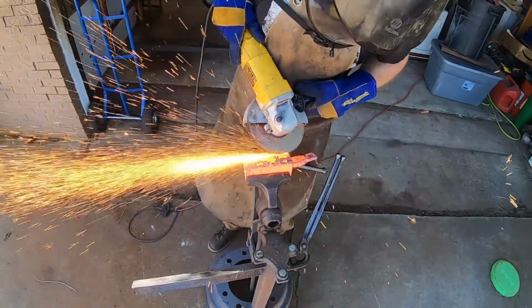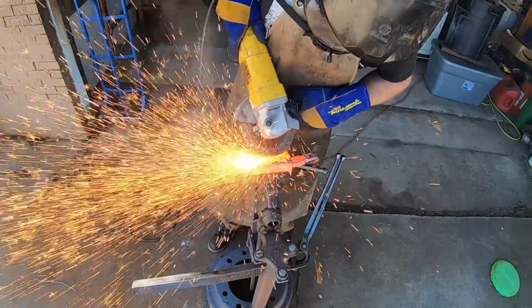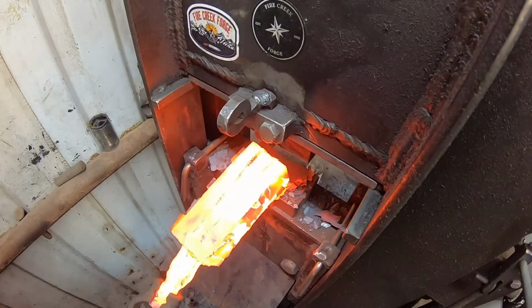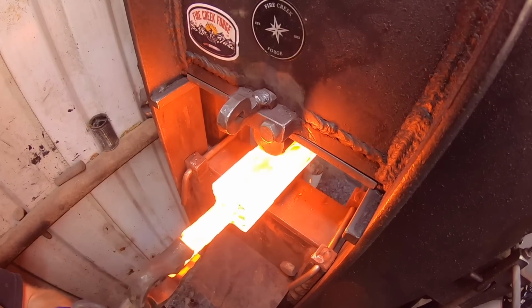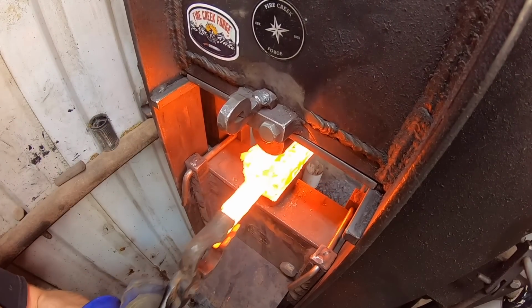Once we've got the forge weld set, once again we need to address the sides of the billet and remove that low carbon steel from the welding rod because I don't want that in the billet moving forward. The next step here, where we crush the billet and forge it on the bias to create these C's which we stack into W's, included an accidental discovery that I'll try to explain.